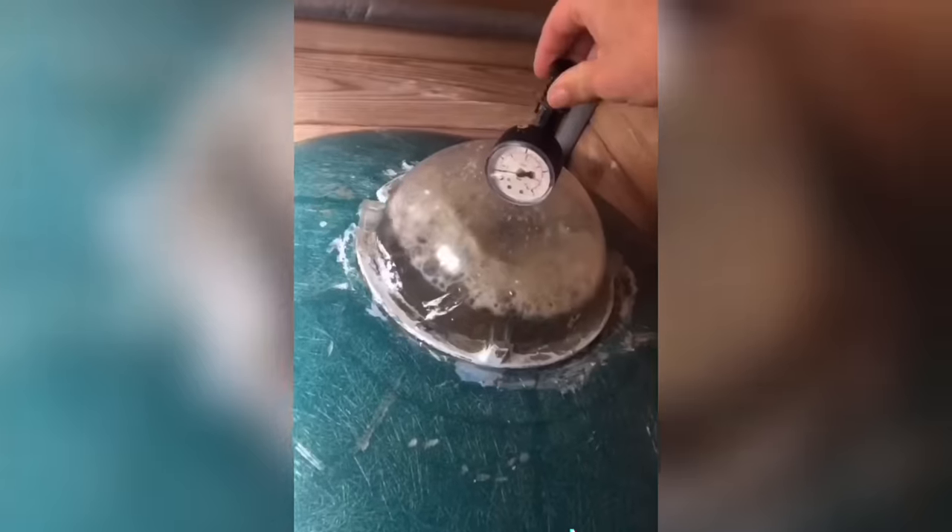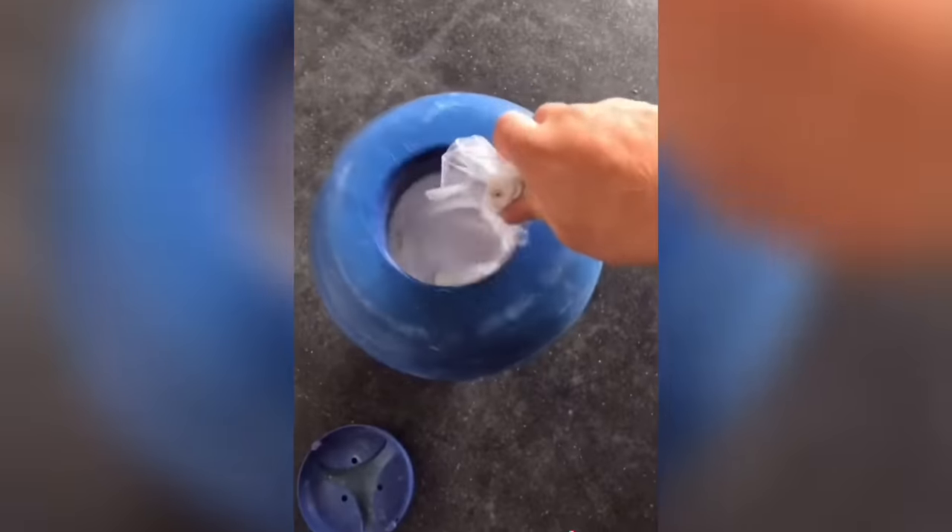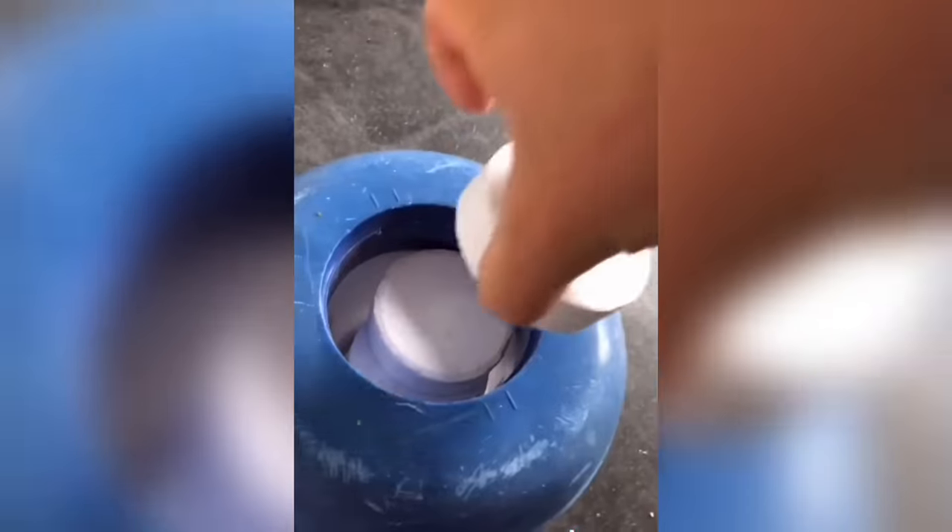Come to this job today - got a bit of a green pool. Going to prime the pump up first, then give it a backwash, then rinse, and onto filter. Shock and chlorine granules - shock going in first then the chlorine. Brush the whole pool - steps first. Thought I'd get the granular flock out as well and put it in around the pool, stick it on recirculate. Put some chlorine tabs into the floating dispenser, open it wide at the bottom and chuck it in. Turn the pump off and see what happens in part two.